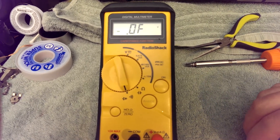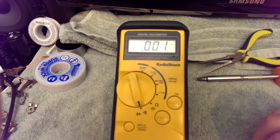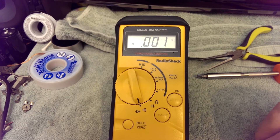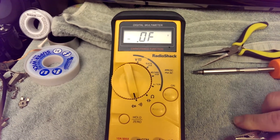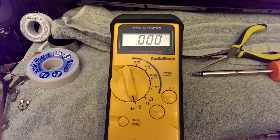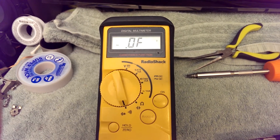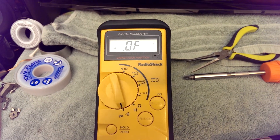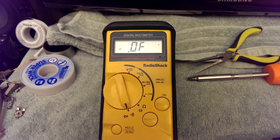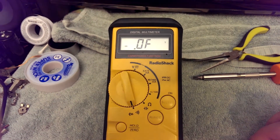Test the other lead. If you see a voltage drop that low, it's shorted. We'll try it in the other direction — also shorted. So base-to-collector is conductive in both directions, which is not good, and our collector-to-emitter is a dead short. This transistor is bad.